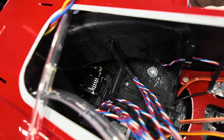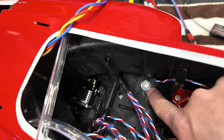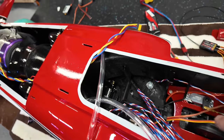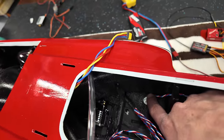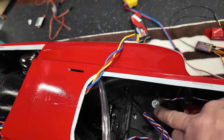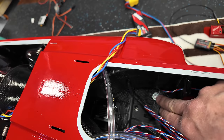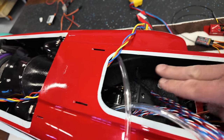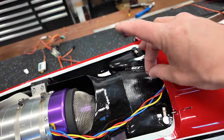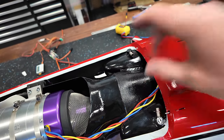All right, so I installed the vent fitting right there. The reason we put it right there is there's not a whole lot of room. I wanted to keep it away from the intake, so I tucked it right there. Figured there would probably be the most amount of room. Now our vent line is just going to come straight up against this wall, go back to our T right here, and come from our two saddle tanks.